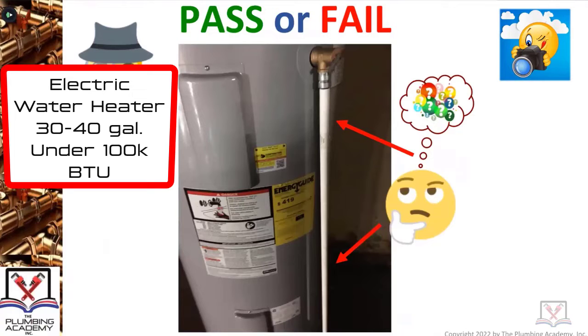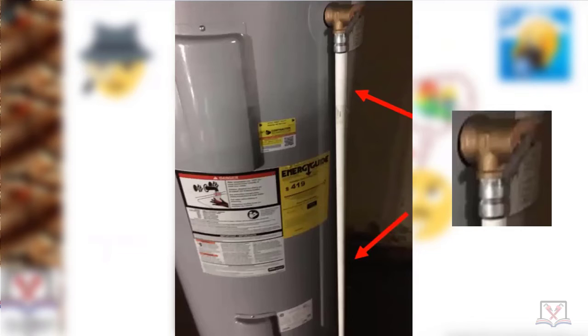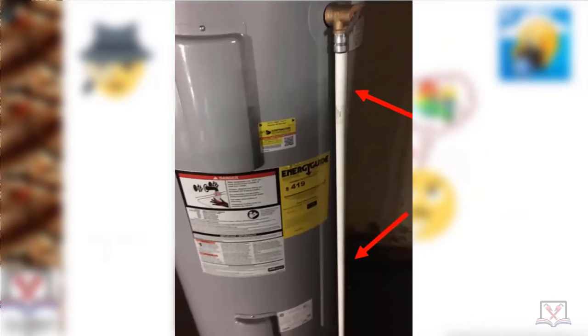We're anticipating that you all know about this. Doesn't the discharge have to be non-ferrous tubing? 99.9 percent of the time that is absolutely true, but in a case where you have a water heater — whether it's electric, natural gas, or propane gas — and it's under 100,000 BTUs, you can use this thing here. This is the only case when you have a temperature and pressure relief valve in the downturned position. The water heater itself is under 100,000 BTUs.